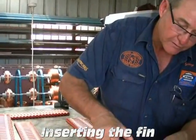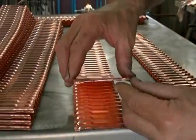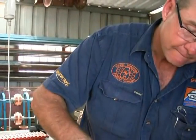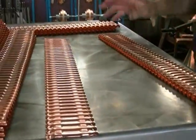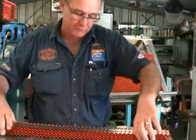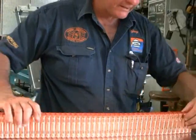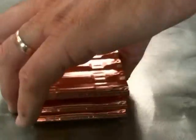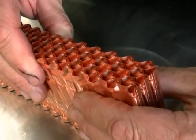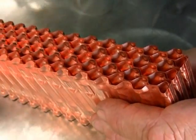It's just a matter of opening up and inserting the fin. Now that's fine. Put that on top, turn it over, put that on top. If we come close, we'll see we are starting to get a honeycomb shape. There we go — three is enough for you to recognise what we're looking for, which is the honeycomb. We clamp that together: there's your honeycomb, there's your lock seams, your tubes, your fin, your tube, your fin — three layers.